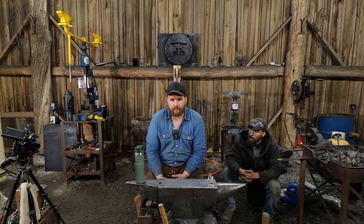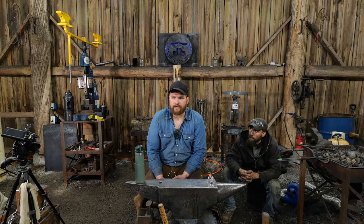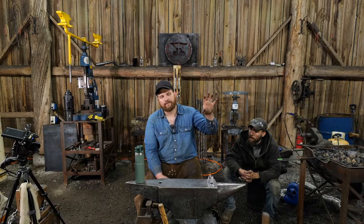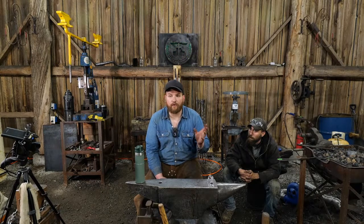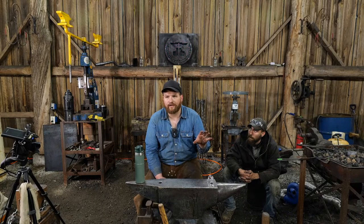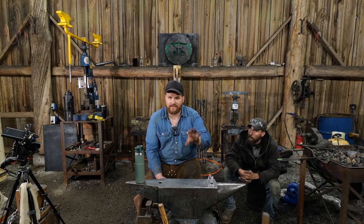And as an FYI, I do plan on doing several update videos on these in the future. Chinese to English is not very good on listings, right? So they use the same listing and cover all their products, like on Amazon, around the Achio anvils. They'll say this one's iron, this one's cast iron, this one's cast steel. Someone will say forged steel anvil. It's cast steel. It's not forged. There's no part of it that's forged. It's a cast. There's sprue marks on it, where they cut it off is visible. It's a cast steel anvil.